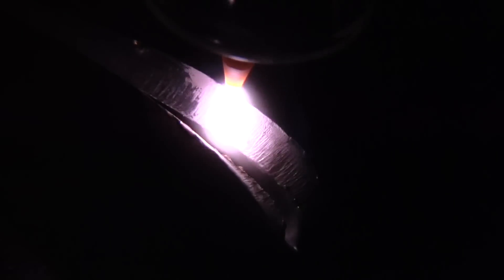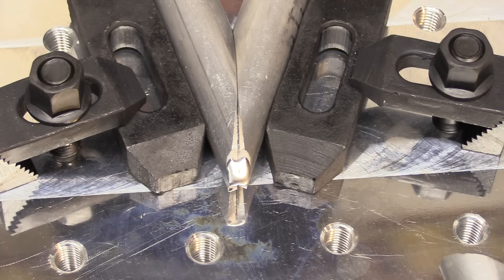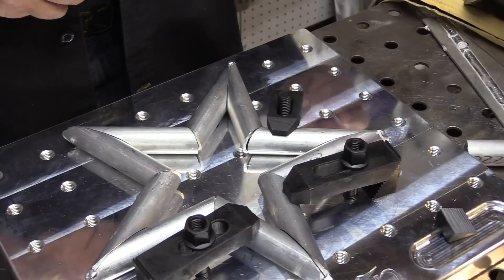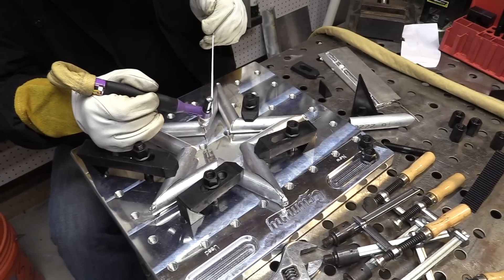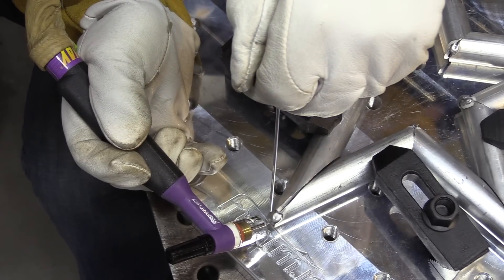I'll show this one more time: making sure both corners are puddling, moving the electrode back and forth. Sometimes you have to get off the amperage to make one of them puddle, then jam some rod in and push a little bit of extra rod in. You don't always have to have everything completely locked down before you get the first tack on something, but I'm going to have most of this thing locked down. Now that I can see there are no real gaps and everything's going to fit, I'll go ahead and get a few tacks on here. Once enough tacks are on it, the idea is to weld as much of it as possible while locked down in the fixture, and then it's probably not going to move a whole lot after that.